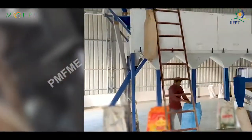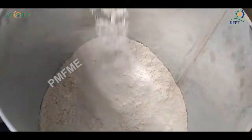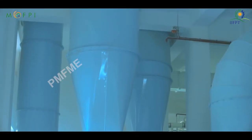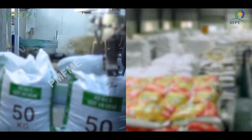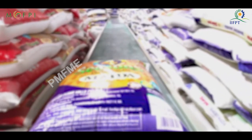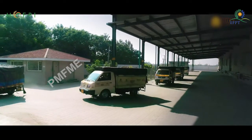The tempered grains are then pulverized immediately. While grinding, care should be taken not to tighten the discs too much because the material is thicker and the discs will choke up more easily. More wrappers will be generated during grinding, so the flour must be ventilated during and after grinding. To separate clean and large pericarp parts, it is recommended to grind with relatively little pressure on the disc and to avoid overfeeding. Sieving is then done to separate the coarse seed coat matter from the flour. The seed coat comes out as flaky material which can be separated by sieving. The sieving mesh can be selected according to the degree of fineness required. The refined sorghum flour is then bagged and loaded out.